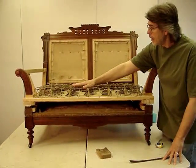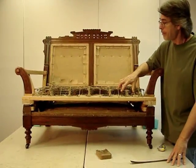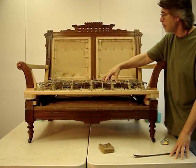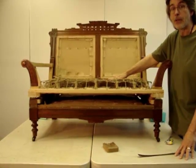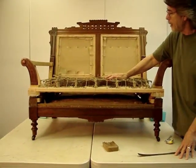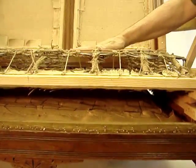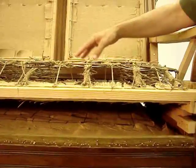You can see the entire elevation of the seat and it's relatively flat. There's a slight crown in the center, which is fine for Victorian pieces. Victorian pieces did typically crown a bit more than the earlier styles, for example in Regency or Empire, but I did not want the piece to crown significantly in the middle. So I really attempted to make certain that the springs stayed down close to the same level in the middle as they are in the front and the rear.